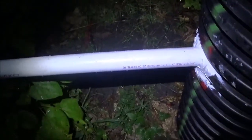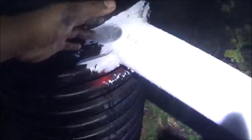The pump will turn on maybe once or twice a week once the snow melts, and then kick the water out. At the bottom of this tank, I'm gonna also put some type of hole in there. Maybe, I don't know, a 1/2-inch hole, because I want it to gradually drain out. When we have a real flash flood, that hole is going to be overcome by the amount of water, and it's going to build up, because that pump will really be pumping. It will build up and then come right over to here and come out. But then it won't stay in here, because it'll have that drain hole and let it drain into the ground.